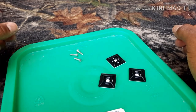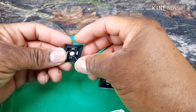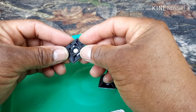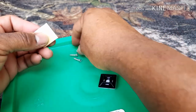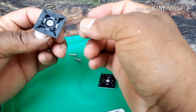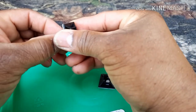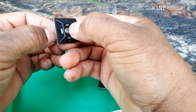I've got some loose wires that I want to secure to the wall. These wires are much smaller than the electrical cable I was securing underneath the fridge freezer, so I'm going to use these smaller, lighter clamps that have double-sided tape on the back. You can either stick them to a smooth clean surface, or in my case I'm going to push a screw down the center and screw it to the surface in the garage area to secure the wires off the back of the fan mounted into the wall.